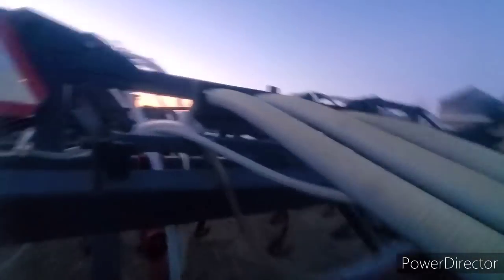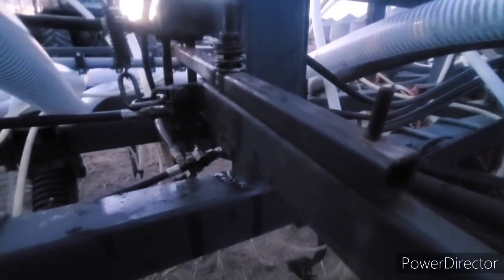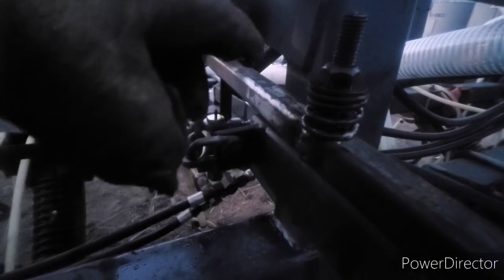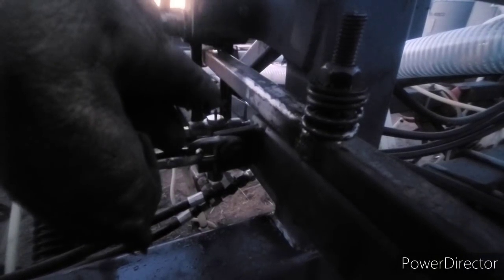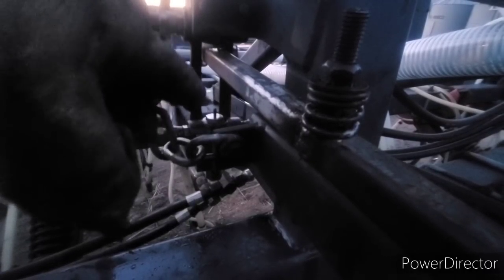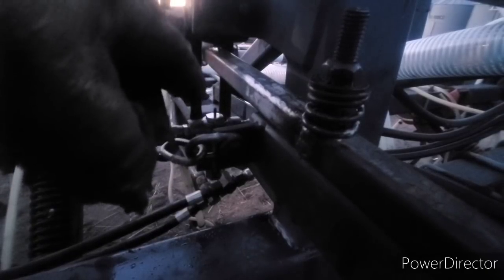If you guys have watched my videos, you'll know my depth sensors were all messed up last year. There are little pins — same as on the bottom — there's that little shiny piece with the pin coming out, so when the bar goes down it hits that pin and shuts the flow of oil off. Last year that was stuck open, letting the oil go through and kept bending the bar. I showed a couple guys how to set your depth on this thing, so yeah, anyway we're going to keep going.